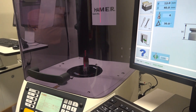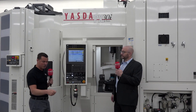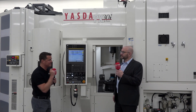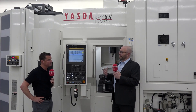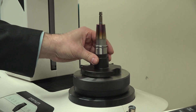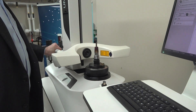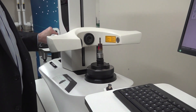Aren't we all trying to keep that spindle running all the time? I used to scroll the spindle down, touch off with a piece of paper, and punch it into the software. But our job is to keep uptime high and downtime low — that's what the presetters do. With the presetters, not only can you check the diameter and height, you can also check your runout and things that would typically take minutes or hours to do inside your machine, now done outside prior to putting the tool in.